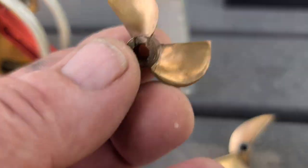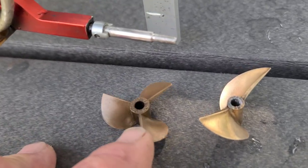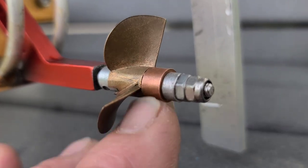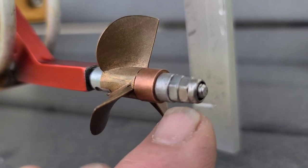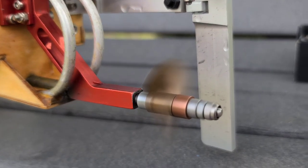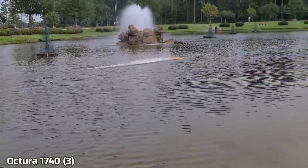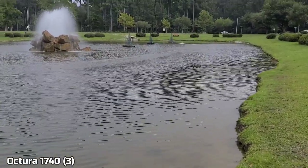I wasn't planning on running it today - it's balanced, it's just tarnished from sitting around for about a year and a half. Never found a good boat to run this 1740 on, so pretty excited to run it. That right there is what you call a big brass spacer - I made it, wasn't quite long enough, couldn't find a washer so I put another spacer on. It'll work. It's actually balanced perfect. With this three blade, the boat won't have as much prop walk - smaller diameter, more pitch, but it's a three blade, so it shouldn't walk out on us. We're about to find out.